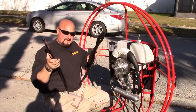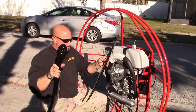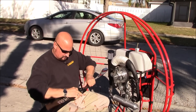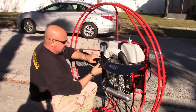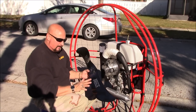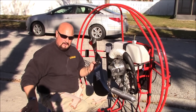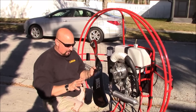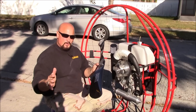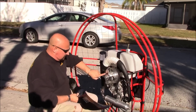The props break into two parts, so when you're traveling and need to fit your unit into a very small spot, you can take the propeller system apart and break them in half. They go together very easily - straight together to form one propeller. When you get the propellers from Fresh Breeze, two are bundled together and the other two are bundled separately, because they're balanced for each side at the factory.